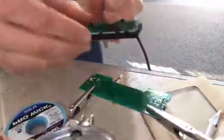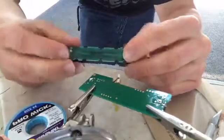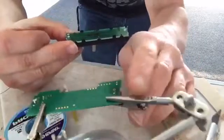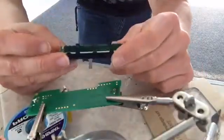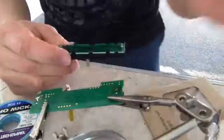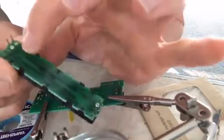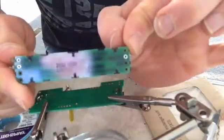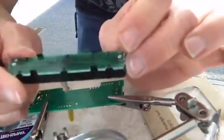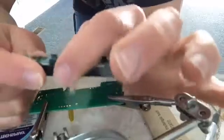Oh, look at that. There you go. It's desoldered and pulled away from the circuit board. This board is the Bluetooth and all that stuff. Now that we've desoldered it from this board, we have to take all of these little pins here and bend them all up. This is kind of similar to an Innofader, but like I said, this is almost like the old voltage control Alps faders. We need to bend these little fingers up to pull this circuit board out.